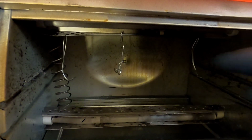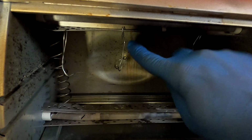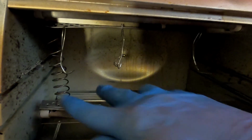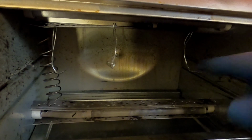For this round, I'm just going to do 3 parts, and I already practiced. I cut some of this wire, bent the wire, and laced it through these holes, and then I tested it to make sure the parts were not going to bounce against each other and would stay in a place where they don't touch each other and mess up the powder.